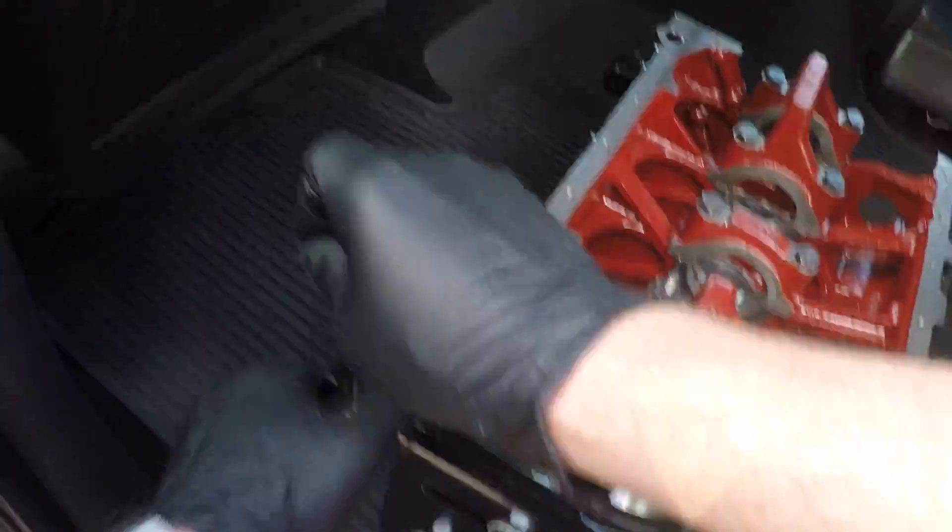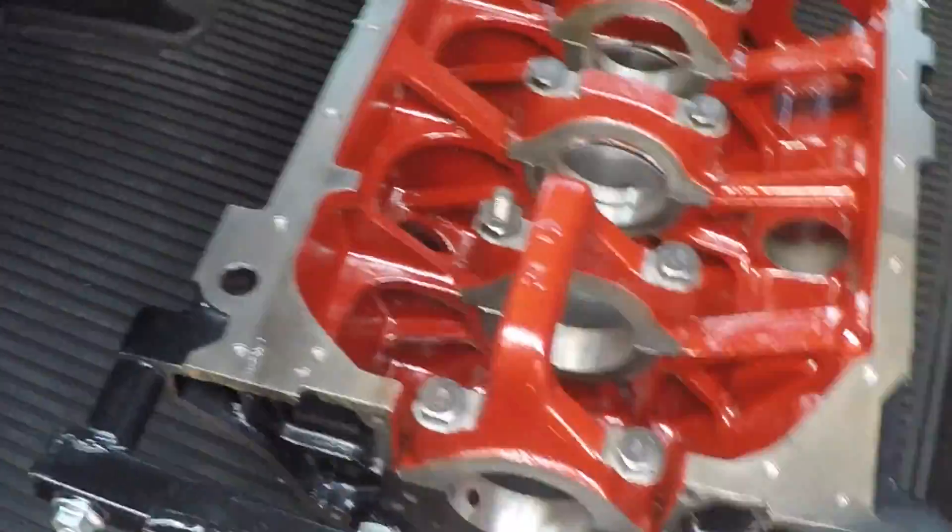Preparation is key to a good finish. The coatings take weeks to dry properly and the drying time is the second most important part of this job. You don't want uncured solvents in the paint to bubble and gas out in the oven because it will ruin the finish. It's such a time sucker that it's just not practical to cover everything in one video.